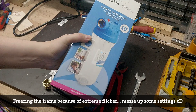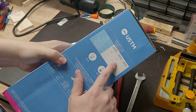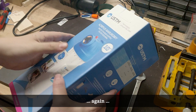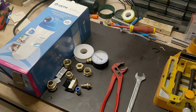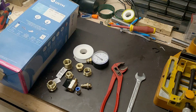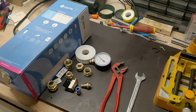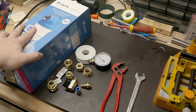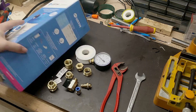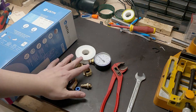As mentioned in the vlog, this is a German water filter — or this one is made in Poland, to be exact. There is a half-inch version, a three-quarter version, and a one-inch version. Water stuff in Germany is still in Imperial — legacy, I guess. This is a 10-inch-long version, rated to 8 bar, which is about 800 kilopascal or around 110 psi. I got this one from eBay for 10 euro. If I were buying again, I'd get the half-inch version, not the three-quarter, so I could reduce the amount of fittings needed.